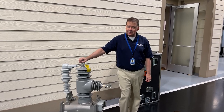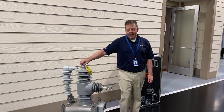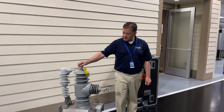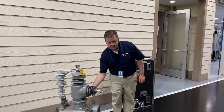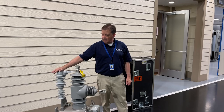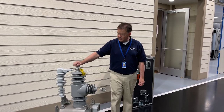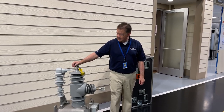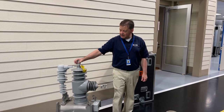From that standpoint, the NXT has voltage capability. In this example, we have six voltage sensors on a three-phase design. The source side voltage sensor is actually embedded in the epoxy, and the load side sensor is an integrated sensor that connects to the load side bushing. So on a three-phase recloser, you would have six potential sensors.